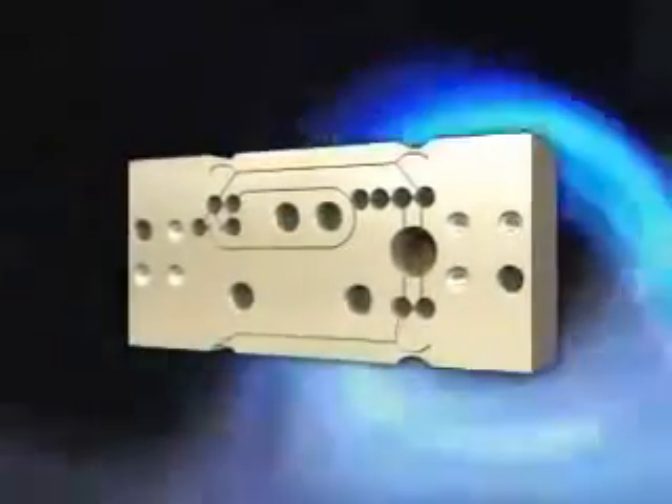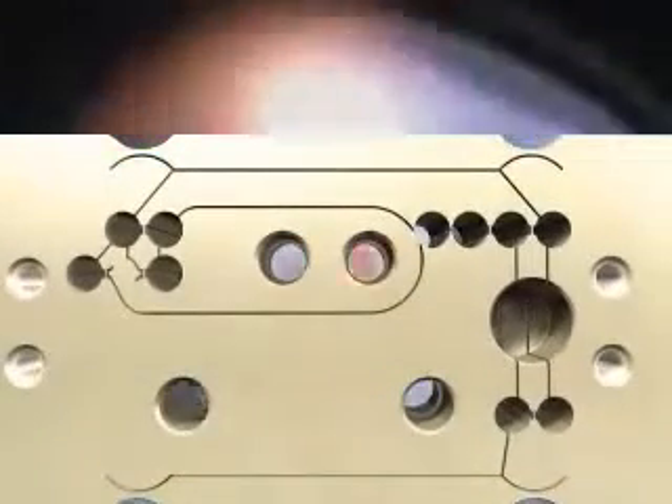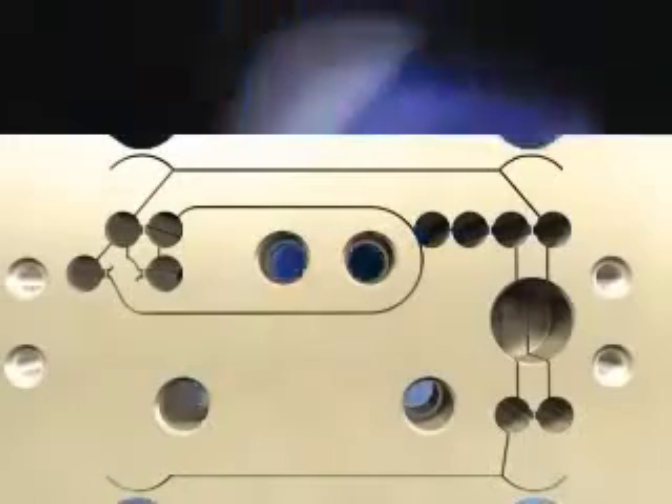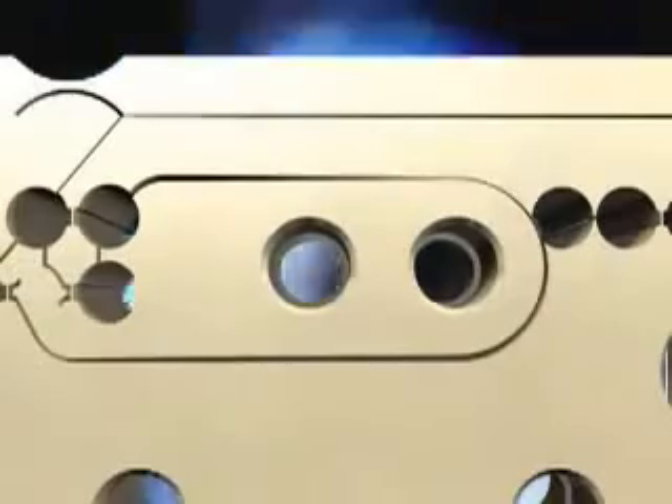UniBlock is a successful result of using a special technology called high-precision electric discharge processing, with a precision of plus or minus several microns — a process that finally cuts a block of aluminum down to less than 100 microns while suppressing the generation of residual stress. This compact body uses a two-stage design where, when a load is applied, two levers move in tandem. The movement generates an electromagnetic force returning the second lever to its original position. The weight value is determined from the amount of current required.